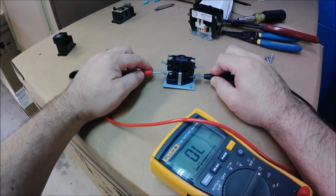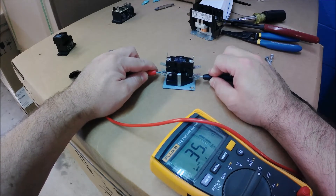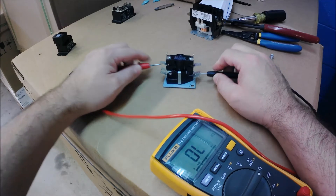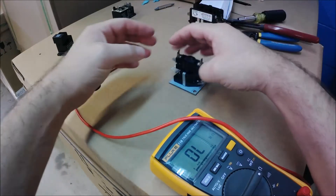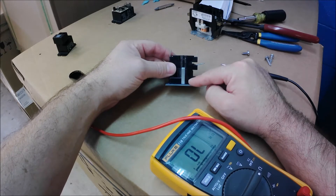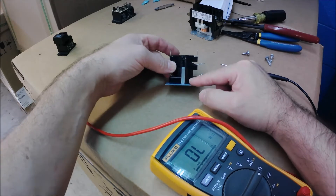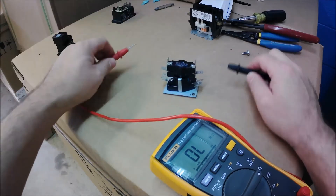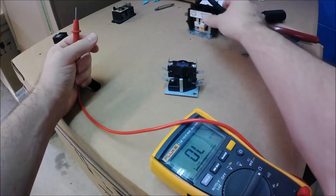Sequencers, however, have a little bit different values — this one has 35 ohms. There's not really a true coil under there. If you take this thing apart by snapping those little silver braces off the side, you can actually see the rods that go up and down, but there's a bimetal disc — or two bimetal discs depending on how many heat strips you have. It's not a true coil. You can ohm it out and get a number, but it's not a true coil like you have at the bottom of a contactor.